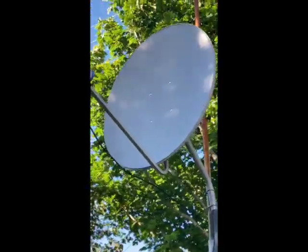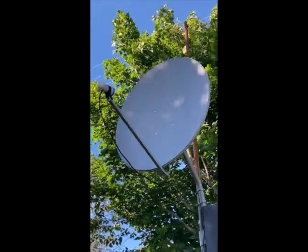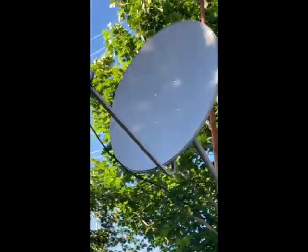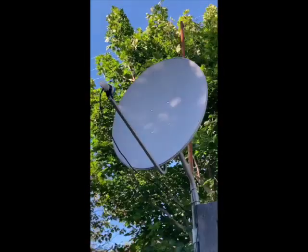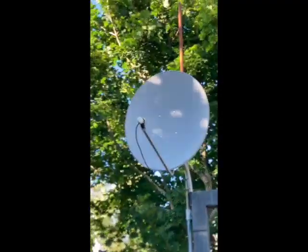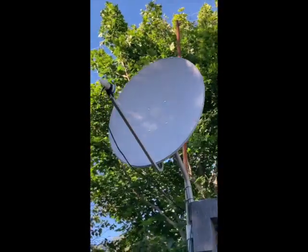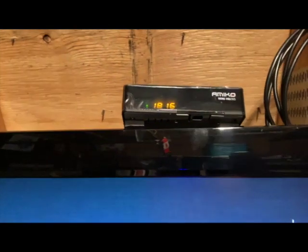There's a good bit to understand about FTA if you want to do it right. Newfoundland isn't really the ideal place because you need a bigger dish — the satellites are low on the horizon, and some are actually below the horizon. If you mount this particular dish correctly, it can't tilt to a low enough elevation, so I had to rig it up temporarily in a way that does work. This dish doesn't have the proper accommodation for low elevations, but there are some you can buy that do — either they tilt down far enough, or they come with instructions to mount upside down. This one does not, so I had to do some special rigging to get it to work.